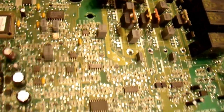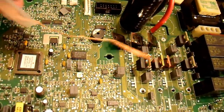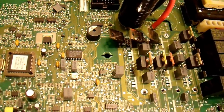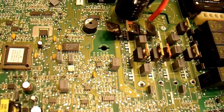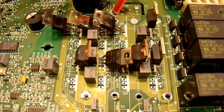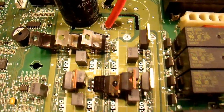The next thing to do is to take some solder wick and suck the solder out of those barrels. You could also use a solder sucker, but I don't have one, so I'm just going to use solder wick. I went through the board and removed the solder from the barrels of all of the non-populated FETs with my solder wick.